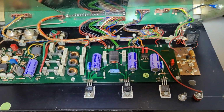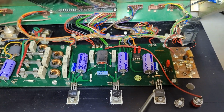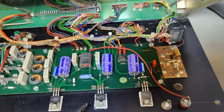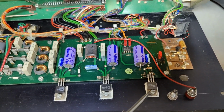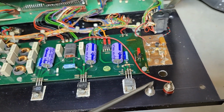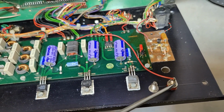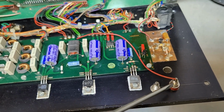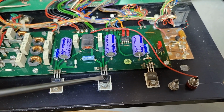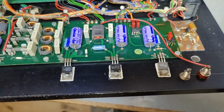Inside the rear panel, we just got 3 voltage regulators for 12 volt and 5 volt and some 8 volt. And I had the idea this one could have been the input, but I'm actually happy that I double checked everything before I just power up something here. Because this is 12 volt output, not input. This is connected to the output of this regulator here. So if I tried to put in something here, I could have blown up everything.